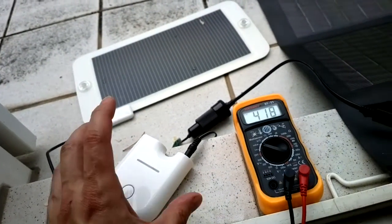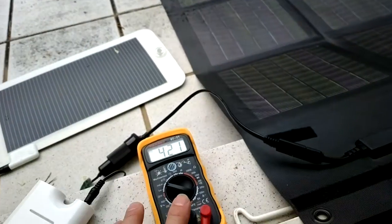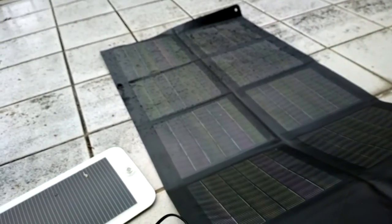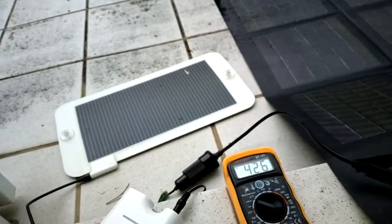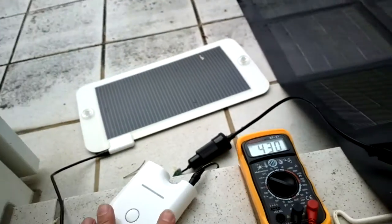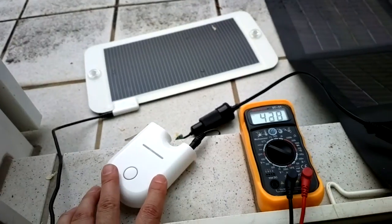Please, if you're going to do this, be very careful. A 25 watt panel is likely to blow your charger in high sunlight levels — anything that's bright sunlight, or even hazy sunlight, could be enough to blow it. So be very careful if you're adding additional solar panels to this setup. I'm only doing this just to see what sort of output we can get.